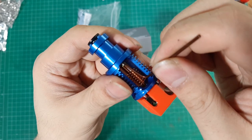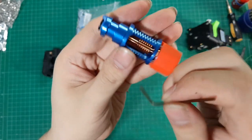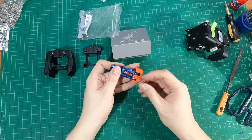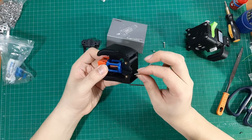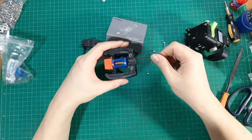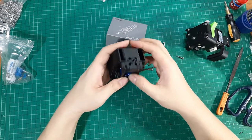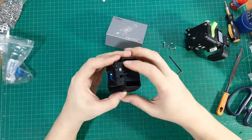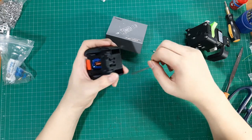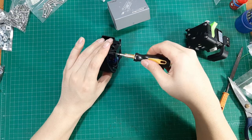In order to remove the groove mount adapter, you need to unscrew two of the small screws with the included hex wrench. Then mount the Dragon hotend to the printhead using four of the screws included in the Dragon hotend kit. Do not tighten the screws yet because in the next step you will have to insert the PTFE tube into the opening, and you may need to loosen the screws again.